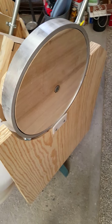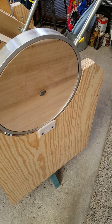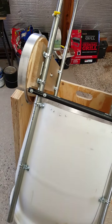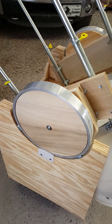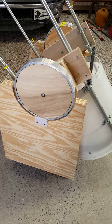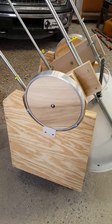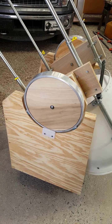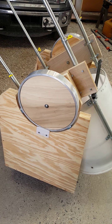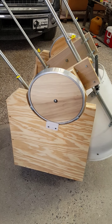I ended up using some of the plastic barrel material for outside stops. It's a really solid set of rings and they work beautifully. The general rule is you need dec axis rings that are about the same size as the optics. In my case, a 13-inch mirror — technically I should use a 13-inch dec ring, but these are 12 inches, and that's close enough. I'm going to pause the video here while I remove the telescope to show you the rest of the base assembly.